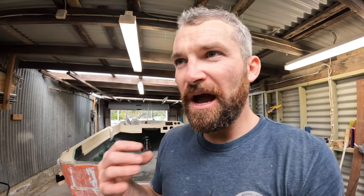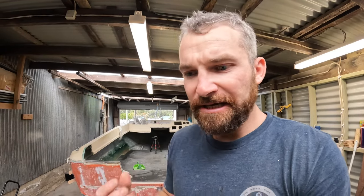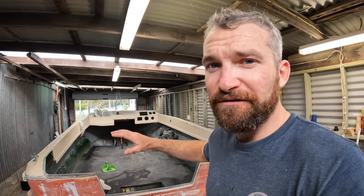So if you want 100% good lamination, you should prime this thermalite board. You don't have to, as long as you do your surface prep right, but if you want this board to bond as best as you can, and obviously it's a lot more time consuming because you need to prime it first, let that cure, come back the next day, and then glass over top. So that's the plan. I'll then lay out all the fiberglass and make sure I've got everything cut perfectly, ready